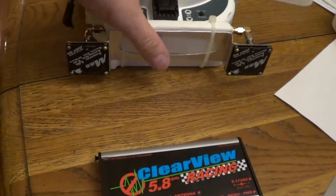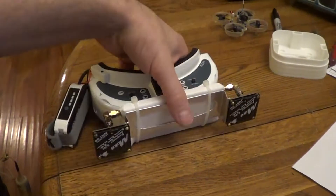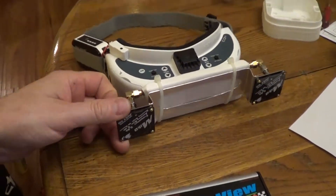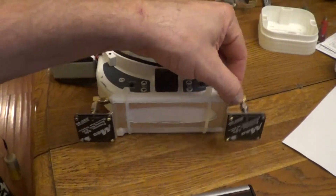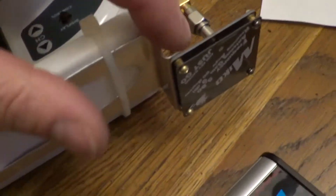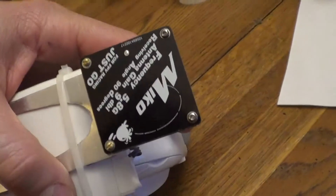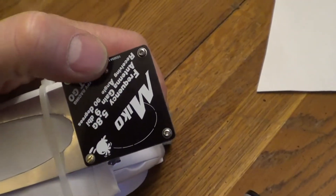The whole idea here is that I didn't use the case, just using the circuit board. The goggles are quite manageable, also very tough. I don't know if I'd want to drop them, but it's definitely tough where you can throw it around and not worry about breaking things, because I've got the aluminum reinforcement. These screws are metric on this antenna, and it doesn't matter that the antenna is upside down — the polarization is where the solder is connected.